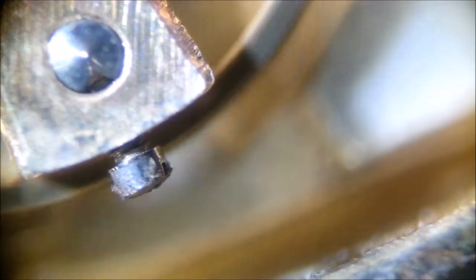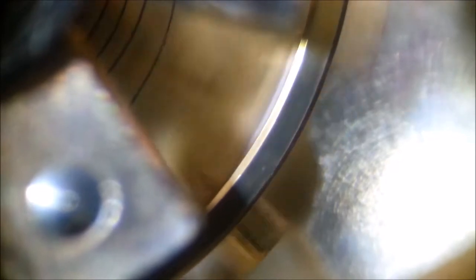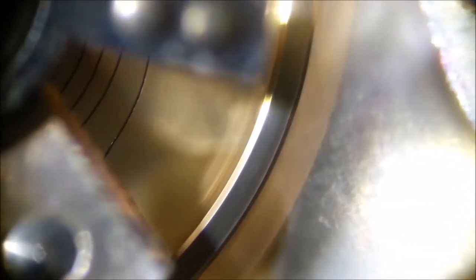You can see the same weight, since this is a smaller flywheel. They put weights on it. Yeah, it's moving a little fast for you to see. Here's that anchor point for the spring. So the spring assemblies are right there. Yeah, you can see that weight, so that weight's kind of swinging around, all those weights are swinging around, and that slows down the wheel. The more weight there is, the more the wheel is slowed.